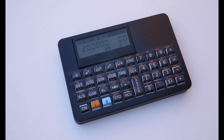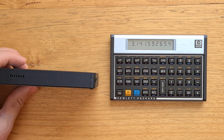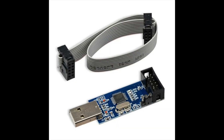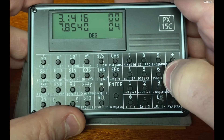For those who are interested, Guido Socha has created an open source STL file for 3D printing beveled keys for this device as well as documents for keyboard labels. On the top of the calculator is a 6-pin port for uploading new firmware, although you will need an AVR SPI programmer with a special 6x1 pin adapter. Alex does release firmware updates fairly regularly — for example, the latest firmware update for the 15C supports a two-line display.